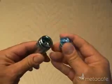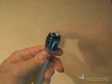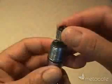removing the ring, the inside reflector, and of course the bulb. You will need to drill out the existing reflector so it sits around the laser housing. Now put everything back together, load your two AA batteries, and here are the test results.